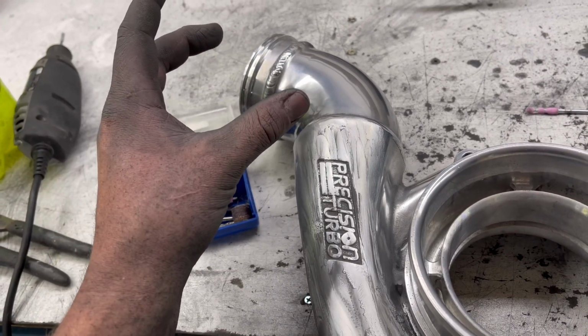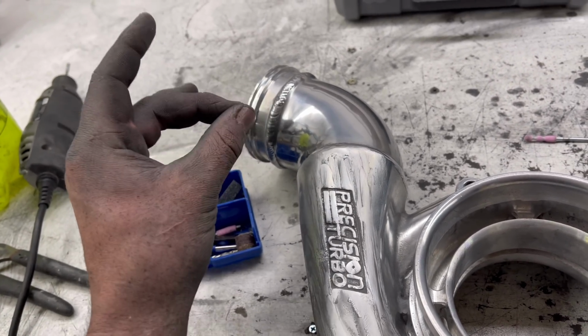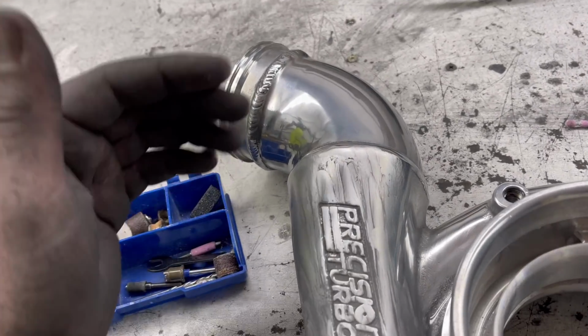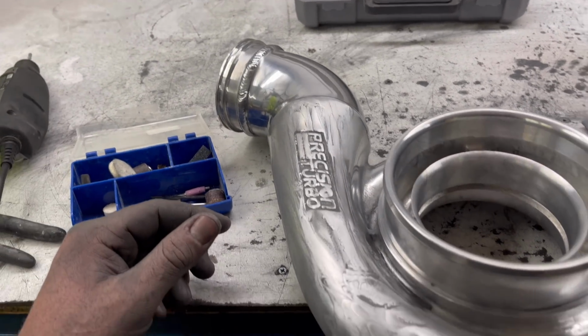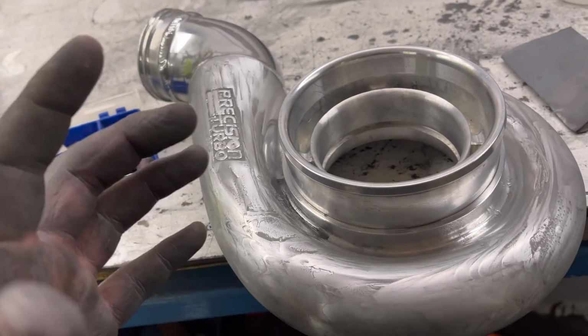All polishing is, is you're making the scratches smaller and smaller until you can't see the actual scratch marks because they're so fine. So then that way the light reflects off of everything instead of grabbing hard edges. There's your scientific lesson of the day. So I'm not gonna time lapse any of this. Now you know what I'm doing, and then I'll show you the end product.